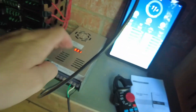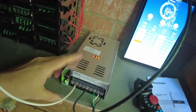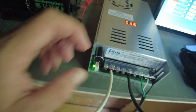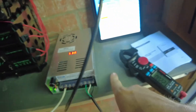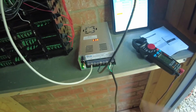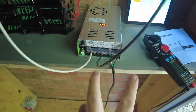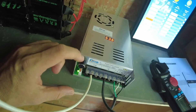These will do 480 watts. I'm going to end up using more than 480 watts when I get more GPUs in here, so my idea is to just parallel up two of these. The other idea I have is that the little adjustment knob is not very fine, so I think I'm going to replace it with a multi-turn trimmer pot so I can finely adjust it. The reason is that if I have two of them, I want them to share the load evenly. I'll shut everything off, let the load run off these guys, and adjust the voltage with the fine multi-turn trimmer pots so the load is completely equal between the two. I'll do a video on that — going to order another one and install a multi-turn trimmer.